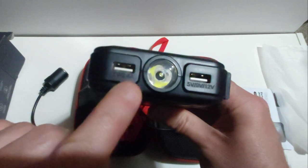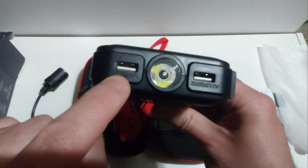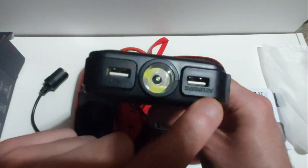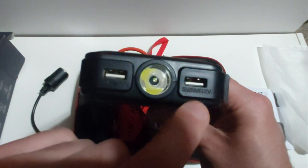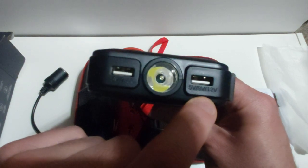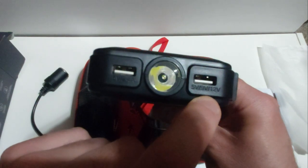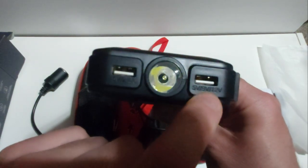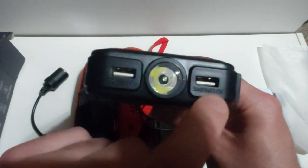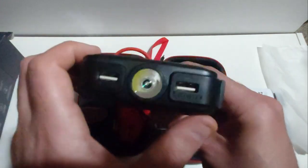Other features I think are very nice: you have a dual USB charging port. The one on the left provides 5 volts at 2.4 amps, and the one on the right gives you 5 volts but up to 3 amps — useful if you need to charge something at a faster rate, like a tablet, drone, or camcorder that needs a little more current compared to a cell phone.